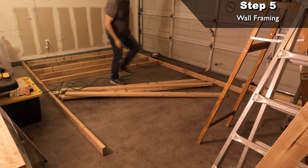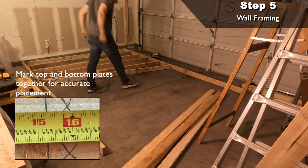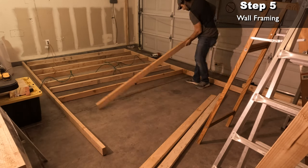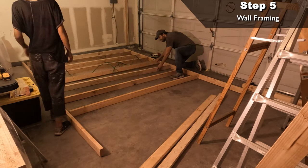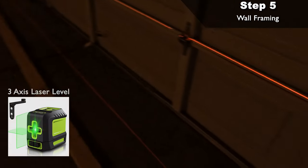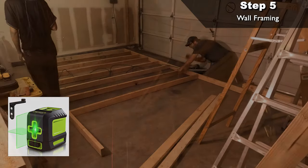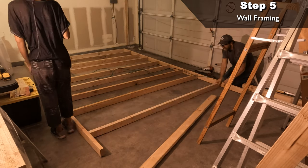Starting with the long wall, I made sure there was enough floor space to lay out all my 2x4s and mark them 16 inches on center like my plan. I included a copy of my framing measurements below so you can see how framing a 16-inch on-center wall is measured. In order to make up the extra space caused by the concrete bases along the bottom of the walls and to allow me to use 8-foot high studs, I framed an area so I could tilt my wall section into it and fasten it after it was all level and plumb. I used a laser level that projects lines on the floor, wall, and ceiling, marked all the lines, and double-checked all the 2x4s before laying out and marking the top and bottom plates 16 inches on center.